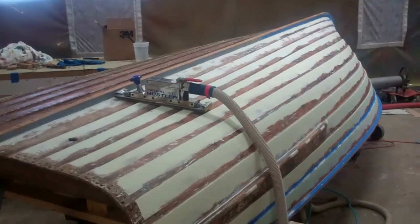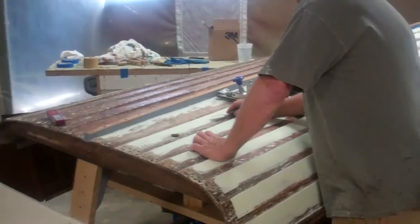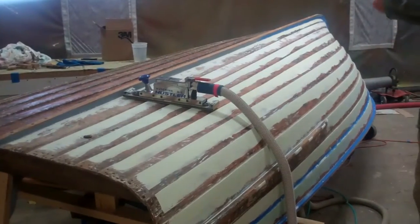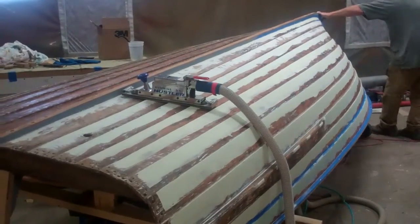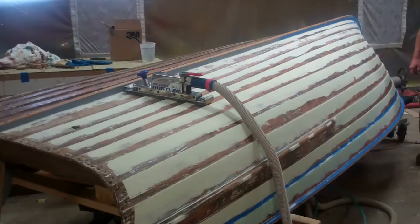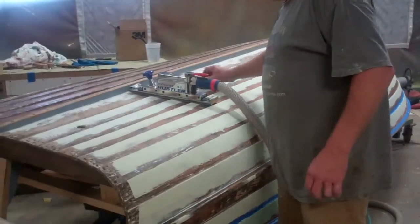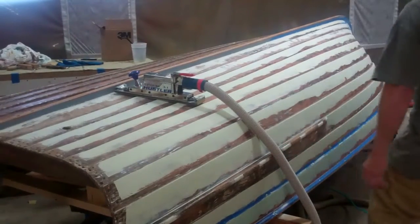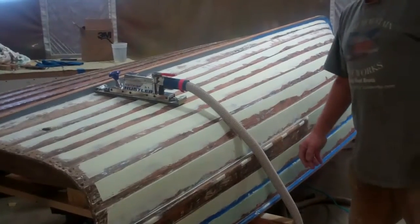Good morning from Snake Mountain Boat Works on Wednesday, September 29. We have made great leaps of progress on the 1949 13.5-foot Lyman Ninnifish — or actually John has. The transom components are fully fabricated, stained, and we're in the process of varnishing all the interior framing components and the transom blank itself before installing it. We have flipped her and John is now engaged in fairing the strakes.